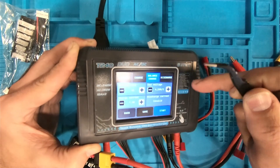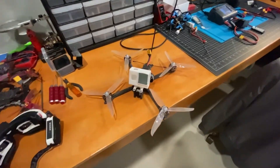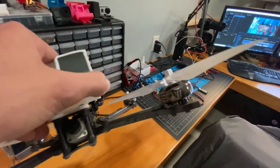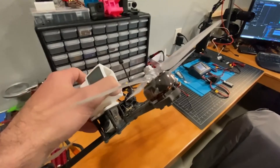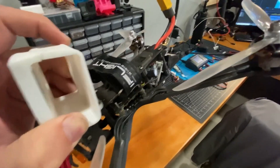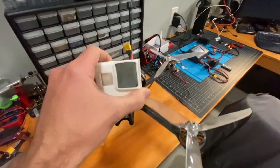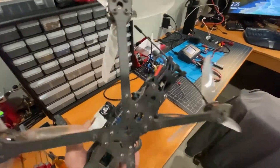I had to show you guys my seven-inch long range tester that I'm working on. It's on a Sedora seven-inch frame — basically the same as a Sedora V1 but with seven-inch arms. It's running the Eco2 2807 motors with seven-inch props. These motors are awesome — they're 15 bucks a pop, super smooth. Originally it wasn't supposed to run DJI, but I was having terrible interference on 2.4 gigahertz, so I went ahead and crammed a Vista unit in there. It's 6S, got the GoPro on the front. So far I've been able to get about 2,500 feet up the side of a local mountain. Check out some footage from the last flight.